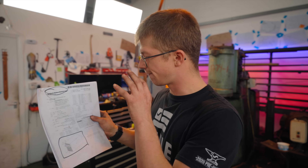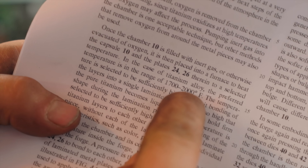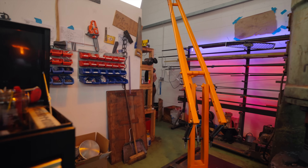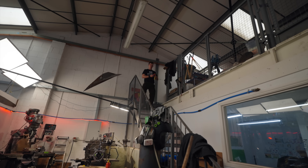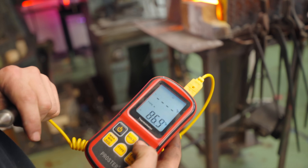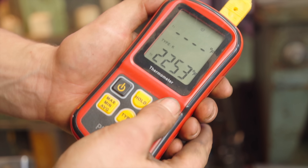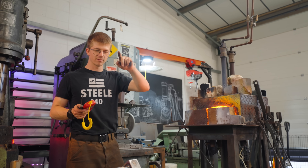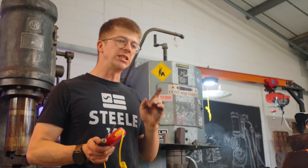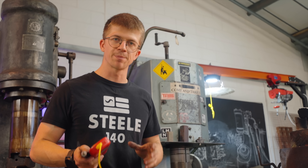Though we've got a fabulous instruction manual, the belly knowledge is not there. We have found the temperature range: 1700 to 2000 degrees Fahrenheit. The forge is currently at 2200 degrees Fahrenheit, so we're going to turn it down a little bit — I'm going to go for the high end, 2000 degrees Fahrenheit. When in doubt, more heat. The only potential downside is that one of the risks in making titanium Damascus is molten titanium explosions. I chose a flow rate of two liters per minute, reasoning that if you were using a TIG welding flow meter as your reference, 25 liters per minute would be high and two liters per minute would be low.